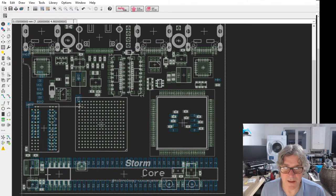There is a switch mode supply here. That's a 1V8 for the DDR RAM, among other things. And there's also a JTAG header. So the amount of memory we've got here is 64 megabytes or 512 megabits, and it's DDR2. So it's pretty rapid, fast enough for our FPGA. And there is some hardware support built into the ECP5 to support both DDR2 and DDR3, etc.